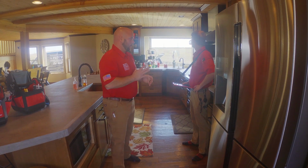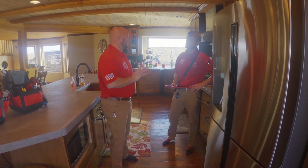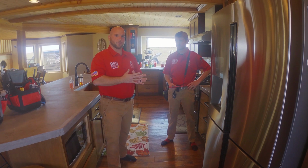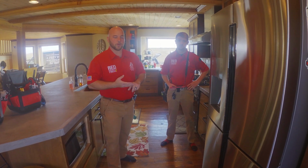to our client. The next thing that we want to do is the three most time-consuming things about inspecting a kitchen are turning the oven on, filling up the kitchen sink, and starting the dishwasher. We want that dishwasher to run and be complete by the end of our inspection, so those are the first three things we're going to start with. So we'll start here at the kitchen sink.